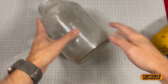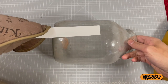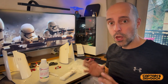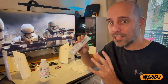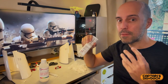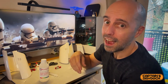To curve the strip I got a heat-resistant glass jar, put on an oven glove, heated the strip up until it was really malleable and floppy, then pressed it onto the glass jar to get the slight curve I needed. Now, I usually use Araldite — a two-part epoxy resin — but I ran out and used a cheaper version, which was not as good. After I took the clamps off those drips peeled away with just a little tug, which should never happen with proper two-part epoxy resin. So the lesson is: don't use something cheap on something precious.